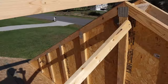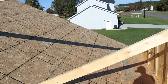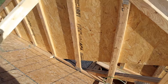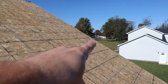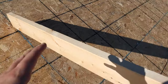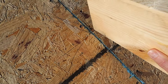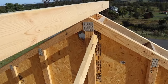After you get the board level, you need to make sure it's square with the gable truss. The best method is to measure from the edge of the roof to the center of the truss — find the center, measure down, make a mark, then pull over from the edge of the roof. Come up to the top, hook on there, measure over the same distance, and make a mark. That's going to be the center of the board, and that's the exact center of where the peak of your roof is going to hit.